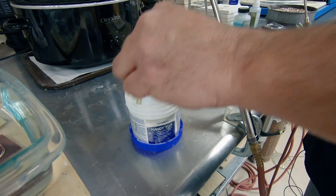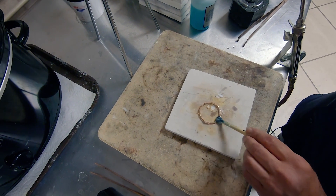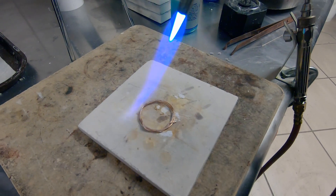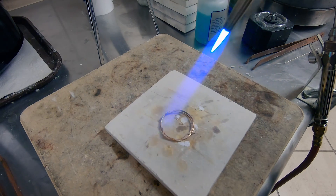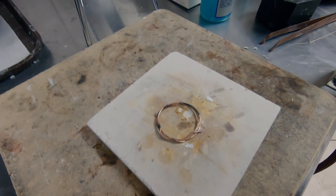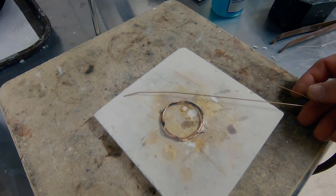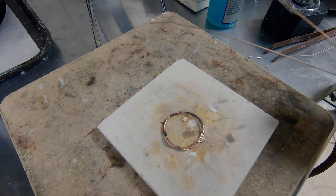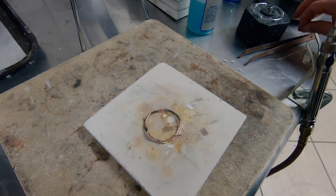We're going to go ahead and apply some flux, just dabbing it on in a couple places — remember, this is just a temperature indicator. I will start heating it. Since the mass is concentrated, it's going to really transmit the heat throughout the piece evenly. The flux is clear — we're there. If you try to anneal wire straight, the annealing is very inconsistent throughout the length of the wire; you can get places where the wire is softer and harder, which can cause brittle spots when forming. This way here gives you a lot more control over the heat, and now you've got a nicely annealed coil.